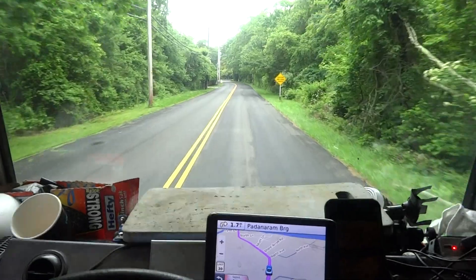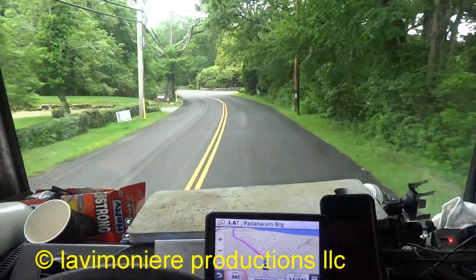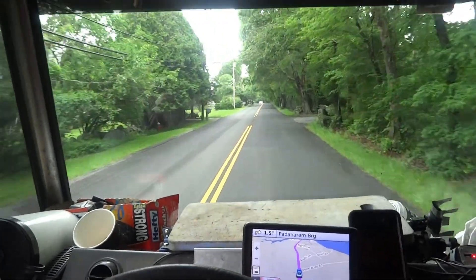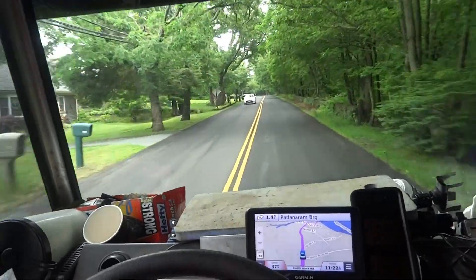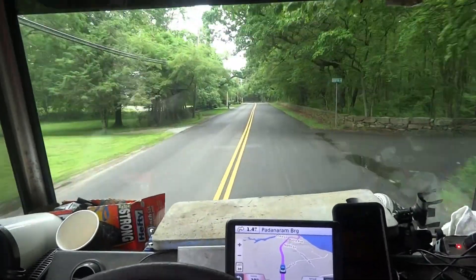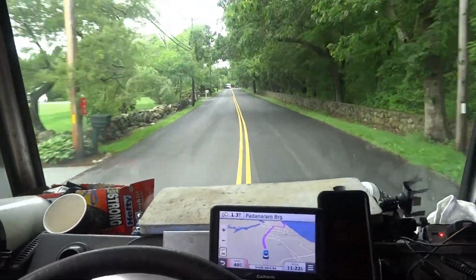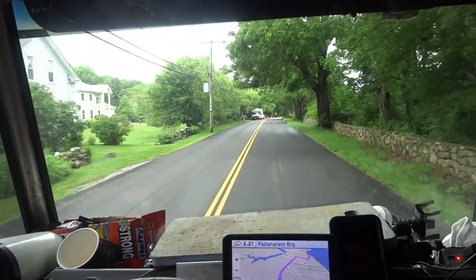Morning guys, June 19th, 2019. I've got a couple of little Goodman ton-and-a-half systems in this guy's house — a little ranch with one on each end. I did replacements; there was a leaking York and an old round Carrier system. I put a couple of Goodmans in there, up on snow legs, ton and a half apiece. It pulls return from the basement. I want to go check them — I've got to take them apart because there are all pine trees there. All the pine needles fall down and get inside the unit. He's had mice problems before, so I'm curious if they're back.